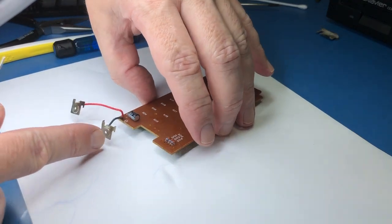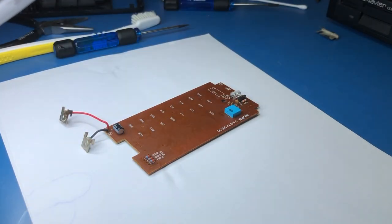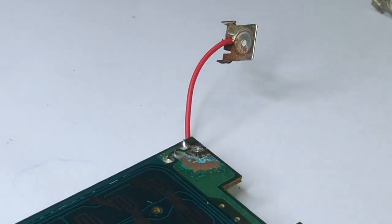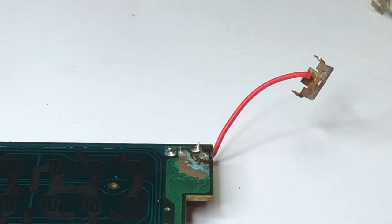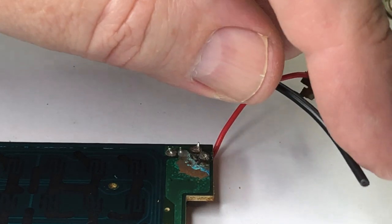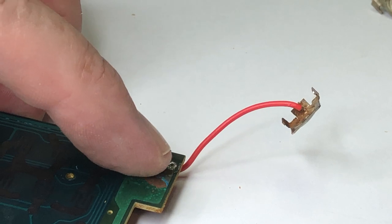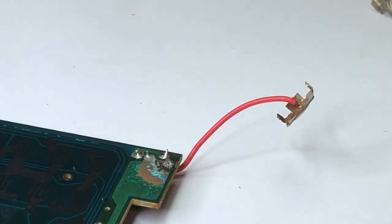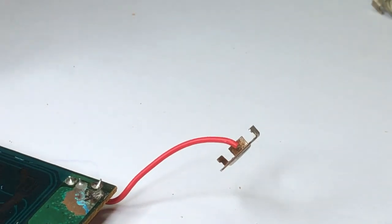So that's more or less cleaned up. This one here looks pretty good. However, I really do not like the look of the solder joint, so I'm just going to redo the solder joint. Okay, so we've got a little bit of a problem here — it's never quite as simple as it seems. You can see here that the solder mask has kind of like flaked away. What's happened is that the battery — well, it's actually alkaline because they're alkaline batteries — the battery goop wicks its way up inside the wire and then it gets onto the circuit board. That's why the solder mask has flaked away, because it started to eat there. The hole that the wire was in is full of gunk, so I'm going to have to clean that out to be able to refit this terminal.